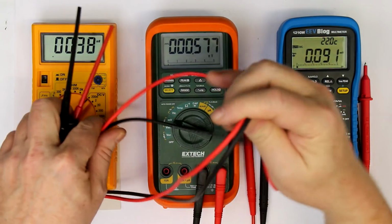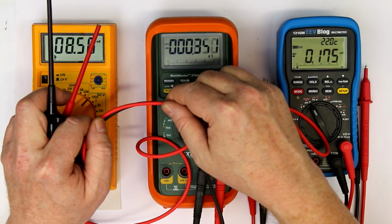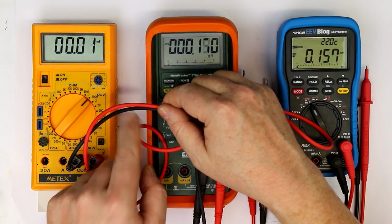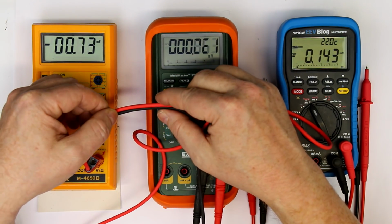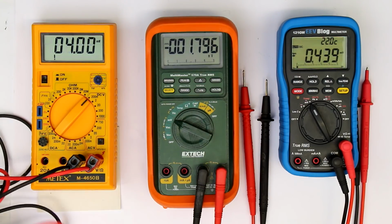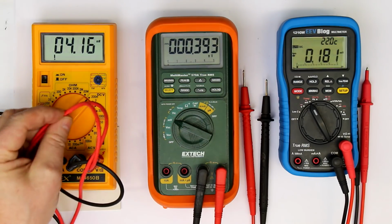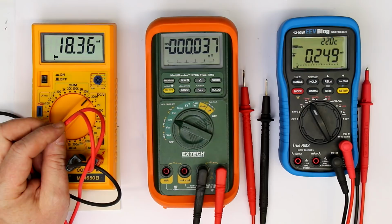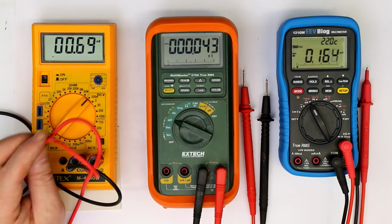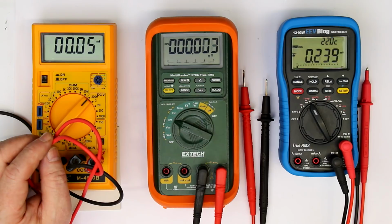And the second is, silicone is much more resistant to heat, especially to the heat of your solder stations, so that if you accidentally have your hot solder tip touching the silicone, it will survive this without any problem, while the PVC leads disintegrate into hydrochloric acid. So although silicone leads are quite expensive, it's a once in a lifetime buy, because they will usually last forever, and once you've worked with silicone leads, you never want to work with PVC leads again.